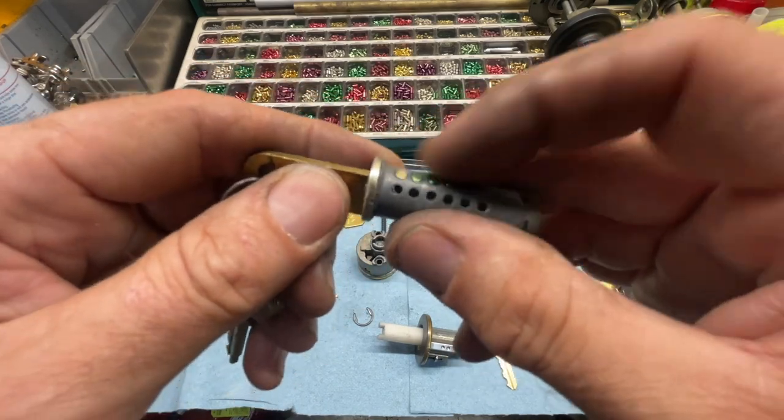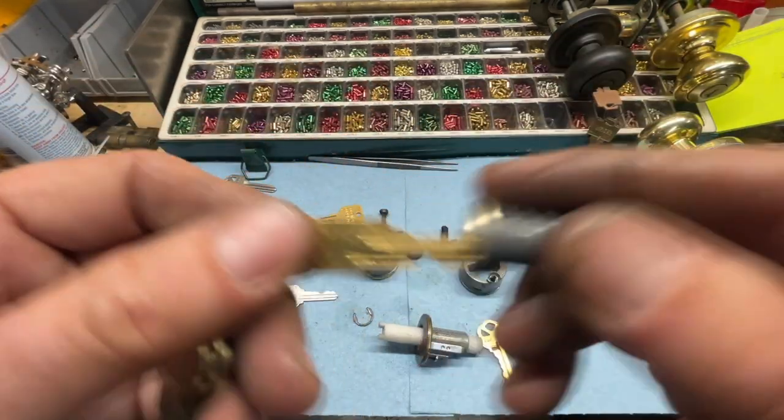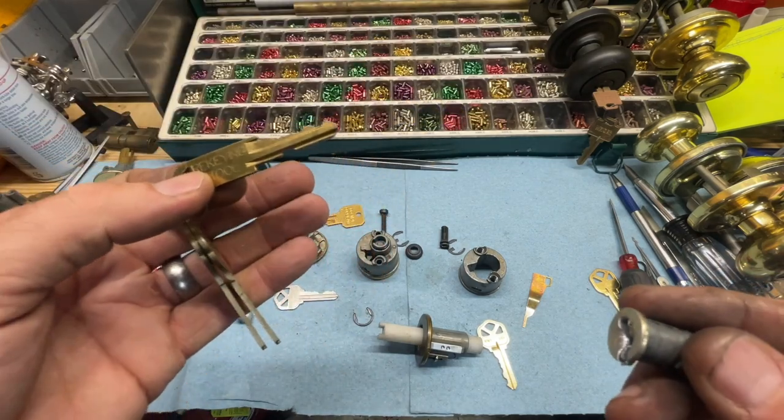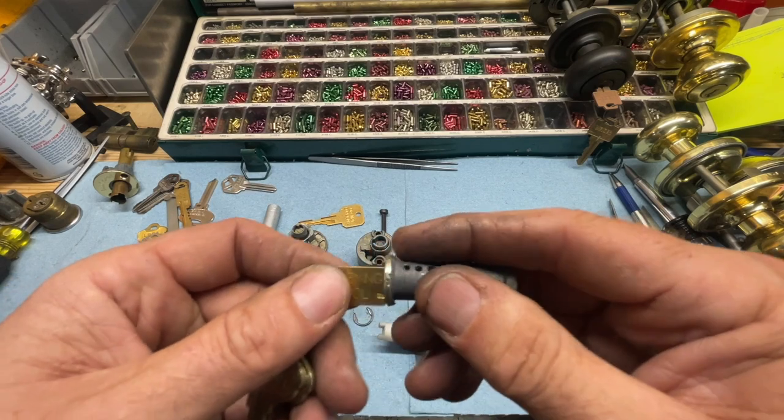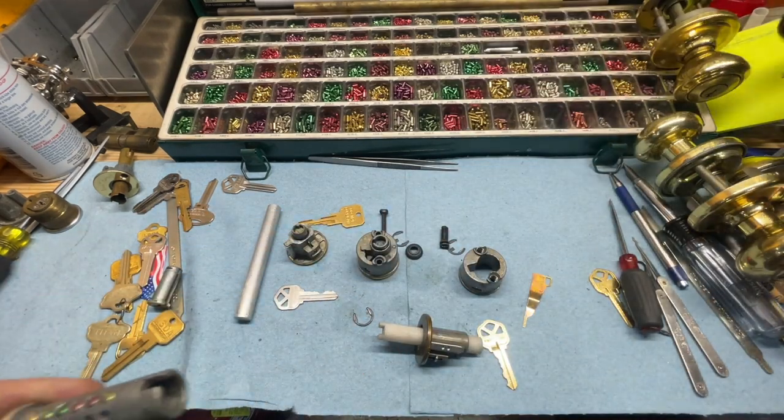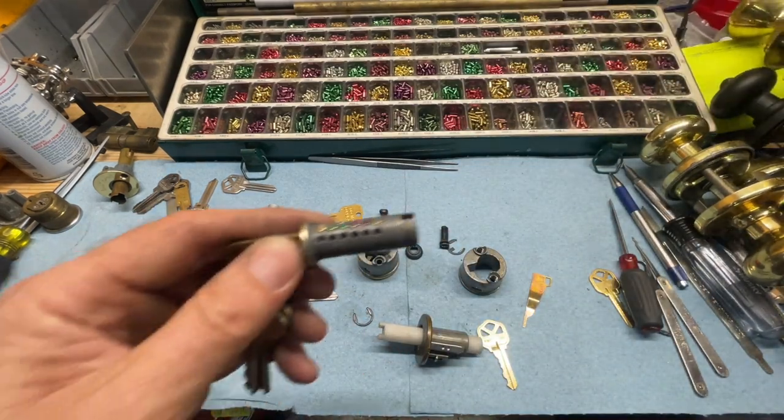And then when you get into master key, I've got one customer that has a 5-pin or a 6-pin KW10 master and then wants all of them keyed to 5-pin keys, it's horrible. You can get really confused with that whole process.